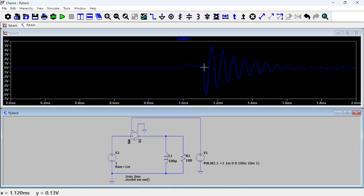If the coil were ideal, you would get the flyback voltage and then it would go back to zero instantly. But a real coil has some parasitic capacitance, which creates an LC tank. An LC tank oscillates, so you get those ringing oscillations. This is a problem for a metal detector because you want the flyback voltage to return to zero as fast as possible, so you need to get rid of that ringing.